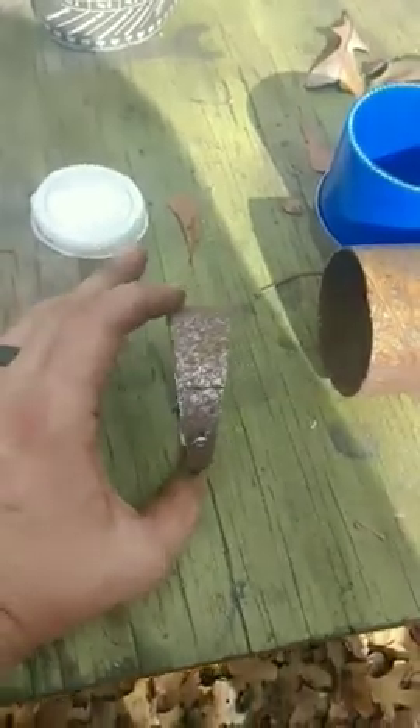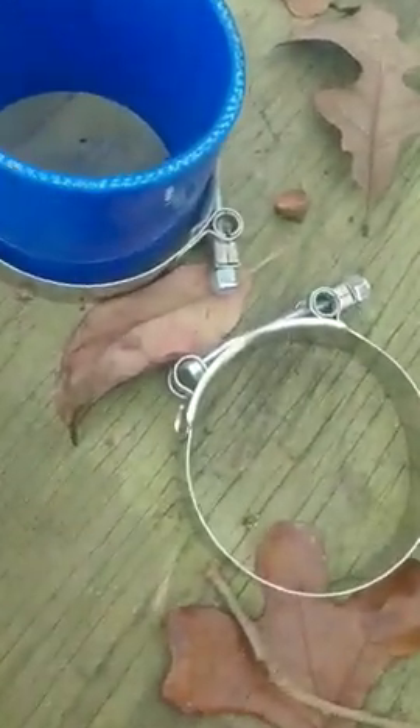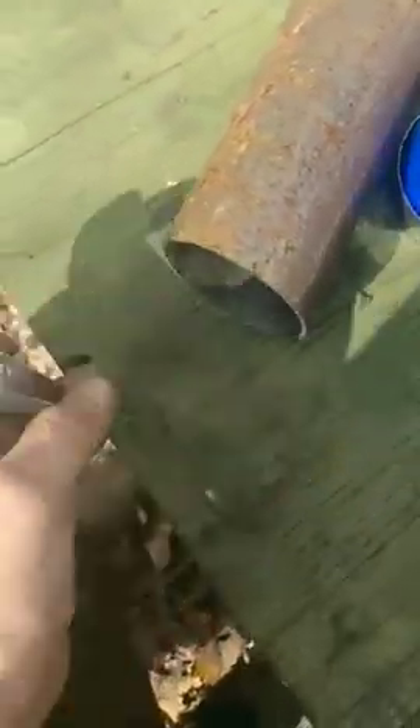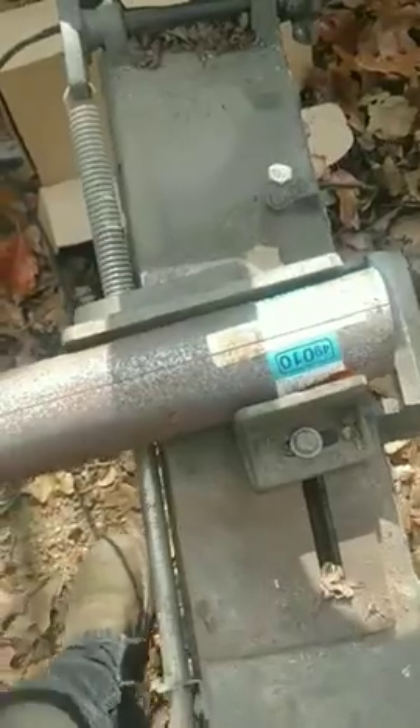Got our second pie cut done. See how that works? It looks like a slice of pie — looks like a three-eighths little lip right here. The reason we do that is because this is cut on a seven-and-a-half-degree angle, so I've got a little bit more bite than on a 45. But when you take it and mismatch it, you get a straight piece of pipe again, and when you flip it over and line the two marks up, you get a rotated curve. This line's on this side — break your saw loose and rotate it 180 degrees until you get that line up on top.